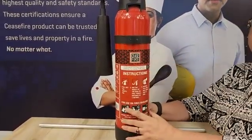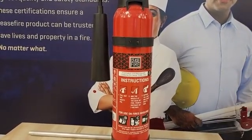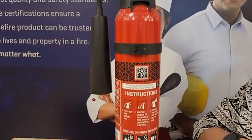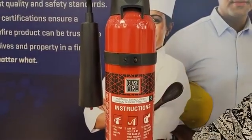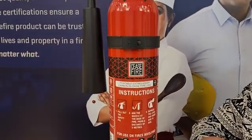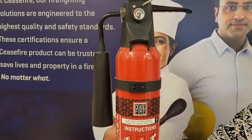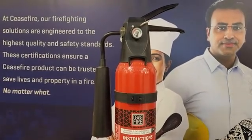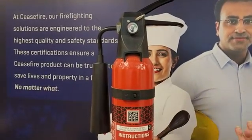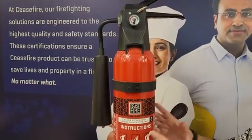The body of this fire extinguisher is PESO certified because this is very highly pressurized. CO2 inside the cylinder is at 70 bars. The pressure in your Coca-Cola bottles or any such fizzy drink bottles is approximately 0.5 bars. The pressure inside a normal LPG cylinder is about 2.5 bar. In comparison, this is 70 bars, and therefore to be able to contain that stress of 70 bars for a very long period of time, the cylinder needs to be strong and tough.